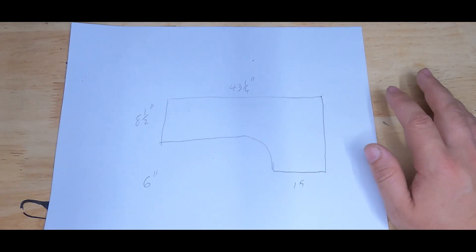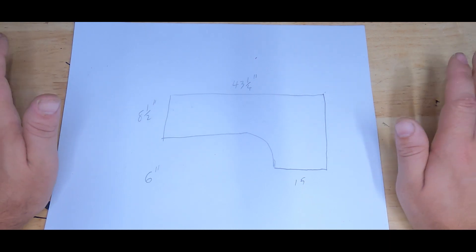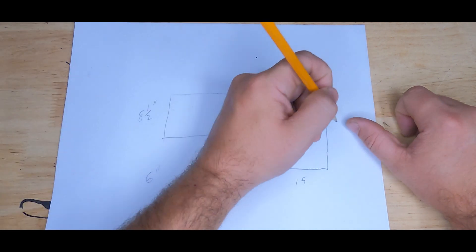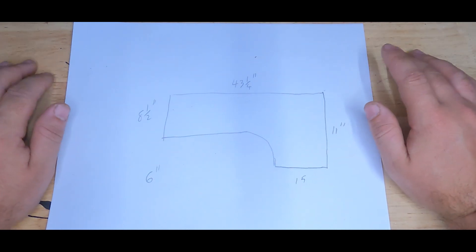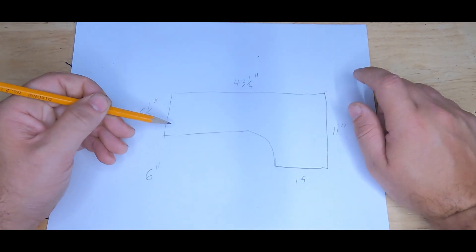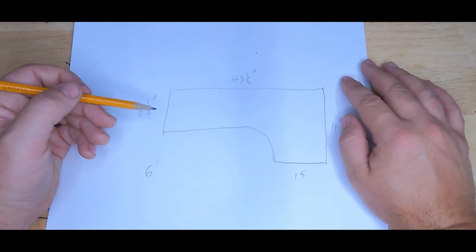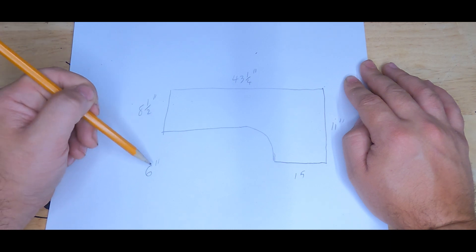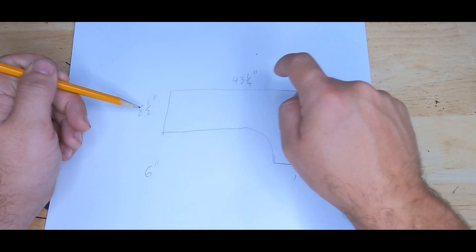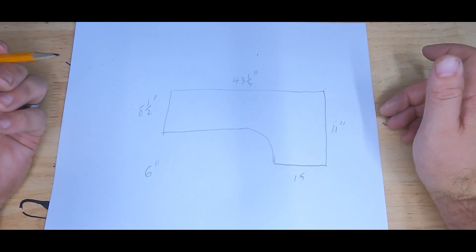Here's our rough little design. I know you're probably thinking, Matt, that is an awful drawing. Yep, I can't draw to save my life by hand — that's why I usually default to AutoCAD for simple projects like this. This is mainly for illustrative purposes. We're going to have a nice little radius here and I'll show you a really cool trick how to draw those. I'm going to put the screws right through the top. I'm going to cut some six-inch pieces at the two ends, minus three-quarters of an inch because that's how thick the MDF is. I want to keep the back as a full piece because that'll help it tie in. Super simple, super easy — let's get moving.